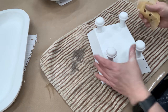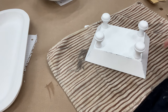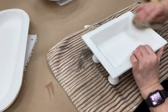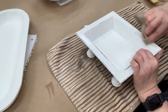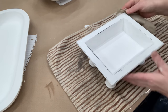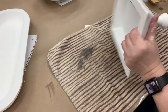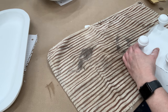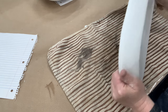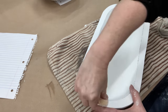I'm going in with some sandpaper first. Because this piece is real wood it absorbs differently, and then I'll come back through and water distress it a little more. It doesn't really matter whichever way you want to do it — sandpaper first and then water distress, or water distress first and then sandpaper, or not water distress at all. You guys have taught me this and I'm figuring out what works best for me. I like a smoother finish, so I just take a wet rag over the entire piece to make it nice and smooth. I go in with sandpaper on the sharp edges to get that distressed look, then back in with a damp rag to smooth out that paint.